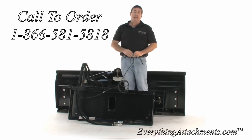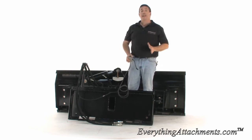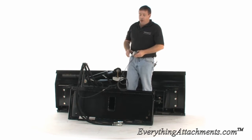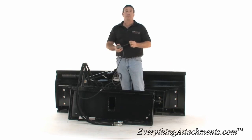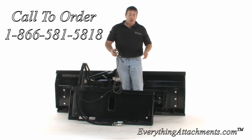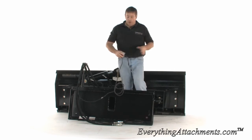The only downside is if your machine ever needs repair and is in the shop and they give you a loaner unit, or you're renting a unit, or you change brands, or try to do anything other than that exact unit — then you're going to need another $250 wiring harness to connect this blade. So I really prefer this magnetic control box which goes inside the cab of your tractor and sticks to anything on your skid steer. It only takes 12 volt to run it. So if you've got three or four different brands of skid steers, trade brands, need to borrow one — you can still use your implement with this type of box. If you choose the custom wiring harness, you're stuck with what you've got and you'll need a different one to operate it on a different machine.